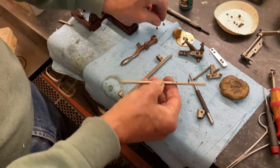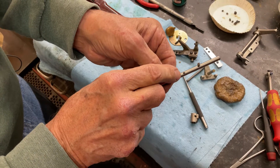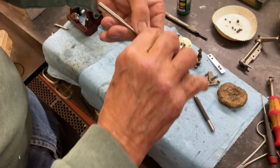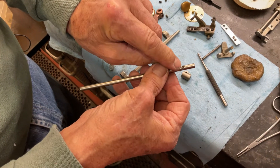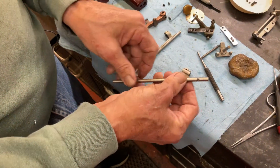But the little set screws — these — have a tip on them like this. And you can see how shallow these little indentions are. Back to the half-nut lift lever part: on your drill press, you can come in here and make this a little bit bigger, and then the set screw will just be sitting down a little bit lower and everything will work. But that's what I have to do. I got it all assembled and figured out, so I had to take everything back apart. Now I'm going to fix that part and put it all back together. And that's my tip for the day.